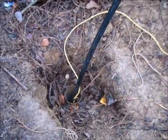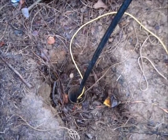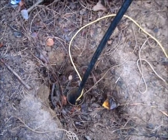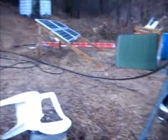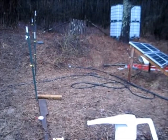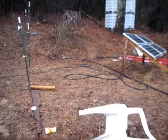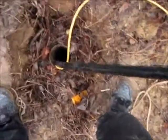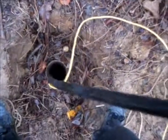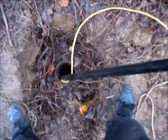I've got a slight problem here. The well pump is stopping at 28 feet down and won't go any further — sounds like it's bottoming out. But you've just seen with the tape measure that it went down 67 feet. I still have about 40-some feet left to go down in the well and I don't know what the problem is. Let me pull it back out.